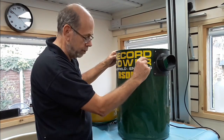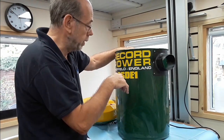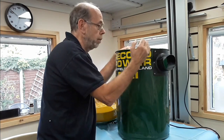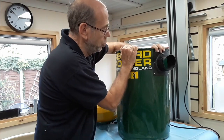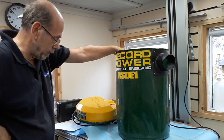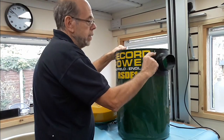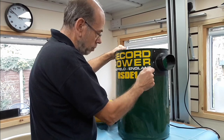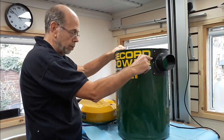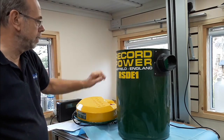I've just got to cut that off all the way around. That will then be screwed into a timber piece which is the top of the actual vacuum. I did think it might be possible to hammer this out but I was surprised how thick this steel is — it would really take a good bashing. So I'm just going to drill the rivets out, take those off, mark out a line all the way around it — probably with a bit of tape — and angle grind the top off it, and then we'll go.